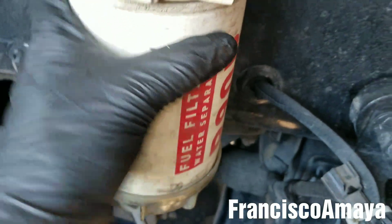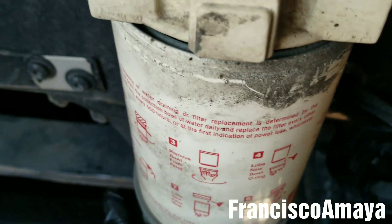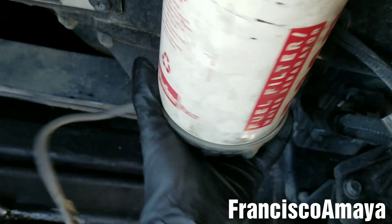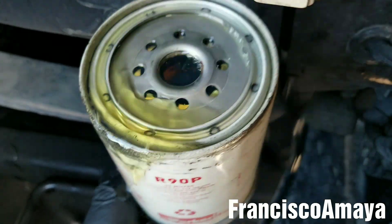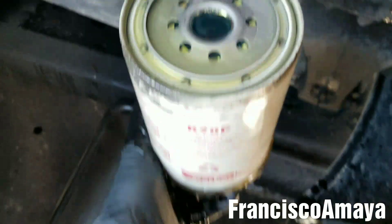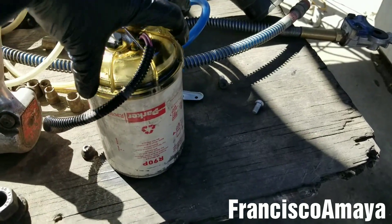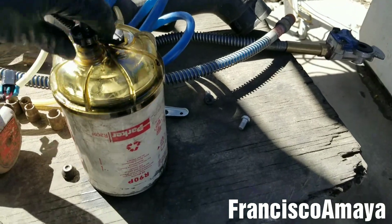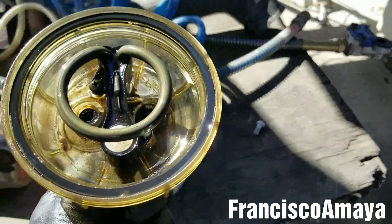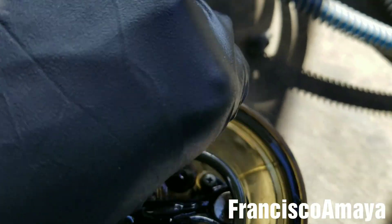There we go — now take it completely out. This is the filter that comes straight from the tanks. We have the secondary filter on the other side, and that filter we'll replace later. Now we're going to drain the fuel completely. Once the fuel is completely drained, we can remove the cup over here — this is where the water is supposed to be collected. I already loosened it; it is not so easy to remove — you have to get it loose first. There is a seal here and we have to remove it.